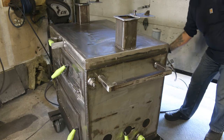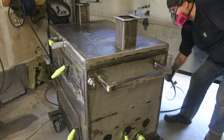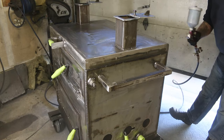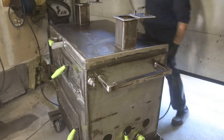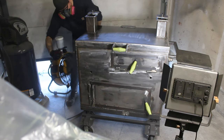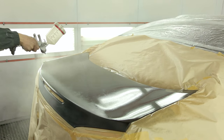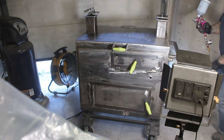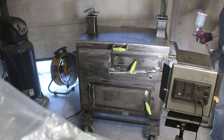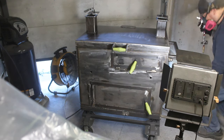I do a very light flash coat initially and wait 10 minutes or so for it to tack up before doing the first full coat. I do that initial flash coat to help prevent running or sagging. This isn't like spraying lacquer or urethane — high temp enamel is a different beast completely. It will run, but isn't as susceptible to it as lacquer or urethane.